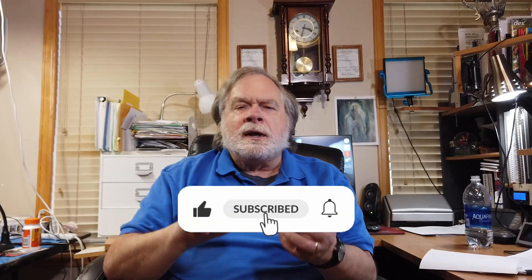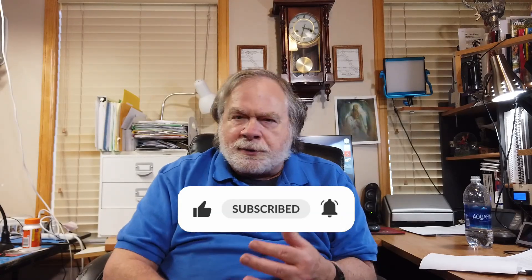Let's talk about charging that battery. To charge it, you want to take it up to anywhere between 14.1 to 14.4 volts — that's only three tenths of a volt different, depending on the type of battery. If you charge it at less than that voltage, you're not fully charging the battery. Now if you use 13.8 from your power supply to pull the battery up, you're actually bringing the battery above its trickle charge voltage, which is 13.3. So if you give it 13.8, will it charge? Yes, it will charge — in fact, it will overcharge. And what happens to a battery that overcharges? It emits hydrogen gas and splatters sulfuric acid everywhere. It's just not something you want to deal with.